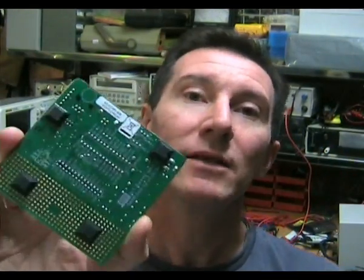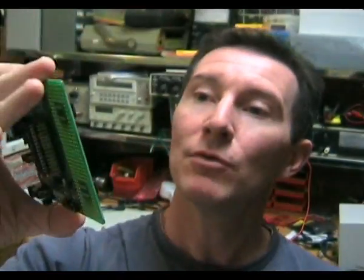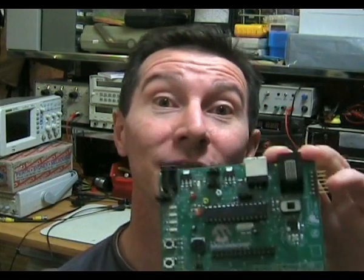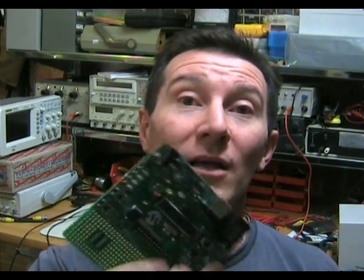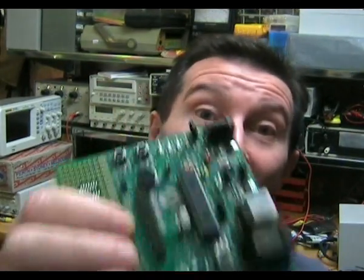Now, this one is a PIC 24F starter board, and on the back here, it's got really nice silkscreen labels of all of the pins on the header connector here. They're all labelled, RB0, RB1, and I thought, great, I don't need to read the documentation for this, it's already there for me. So I hooked it up, and lo and behold, it didn't work. The reason it didn't work is because even though the pins are labelled right, they actually share functions which aren't labelled on here.